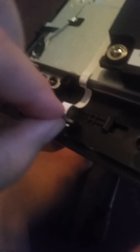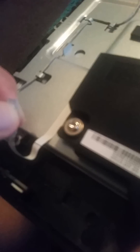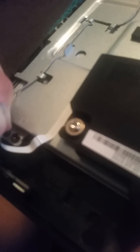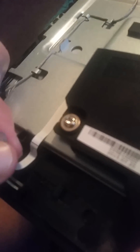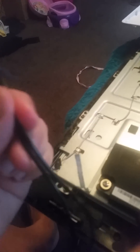You can see where the cable comes into the circuit board on the switch right here. What I did was disconnect this and pull this ribbon out. On the back side of the ribbon you'll see there are four pins. The one on the left is useless to us. The second one in from that is the first pin you want. The third pin is useless to us. The last pin is the second pin you want. Flex that ribbon back so you can see all the pins — pull it up if you need to. Get yourself a piece of wire.